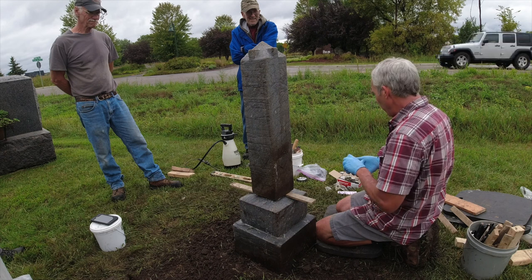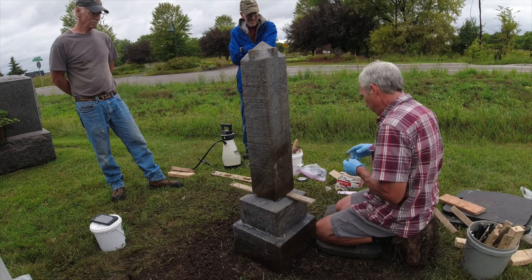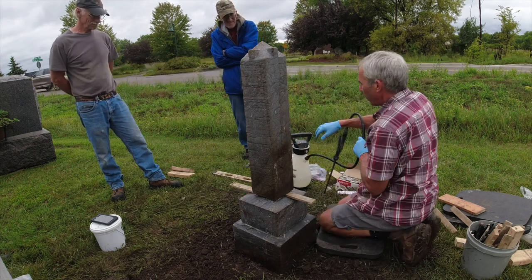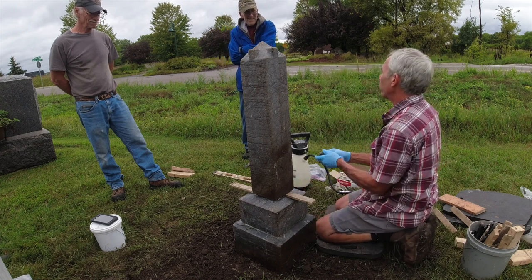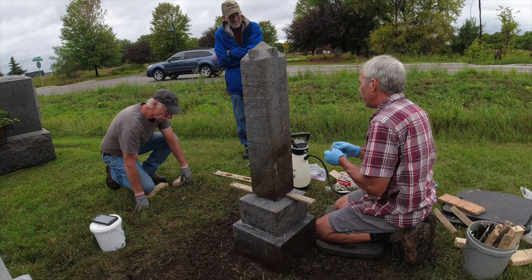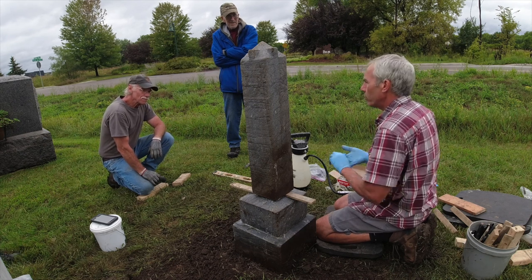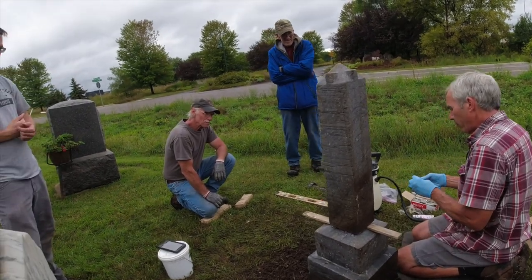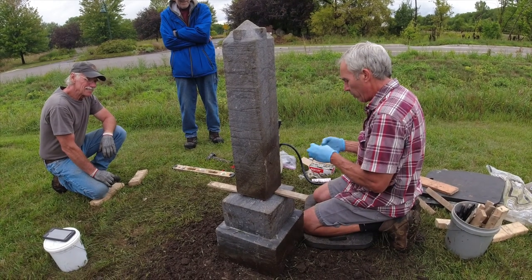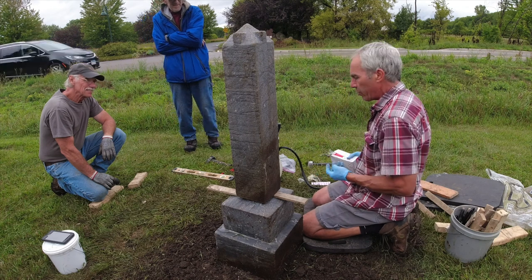This epoxy putty you mix in a one-to-one ratio — I just halved it, but the common one comes in an off-white color. It has some unusual working characteristics: it'll mix and get softer when wet, and it'll also set underwater. After curing you can grind, sand, drill, or paint it, which is unusual because most epoxies won't allow anything on them — so it's a unique material. It comes all the way from South Africa; I started importing it five years ago. It went to the moon on Apollo 11 — it's from the company Pratley. Their claim to fame is that it's the only thing from South Africa that ever went to the moon.